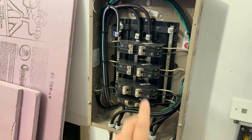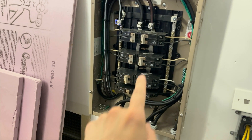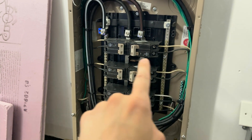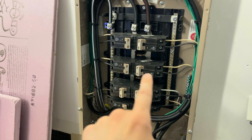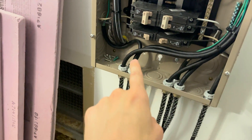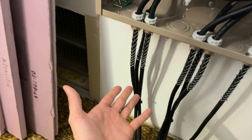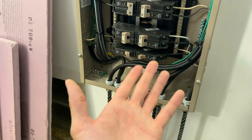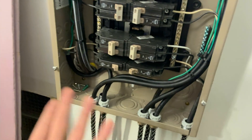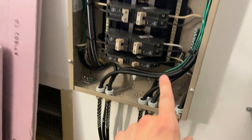So here's my sub panel. It's fed by a 100-amp breaker, number one aluminum wire, and I have 20-amp two-pole breakers here — that gives me 240 volts, 20 amps maximum circuit capacity. I'm using 12-gauge copper SJOOW wire, which is a pretty common heavy-duty appliance cord in North America. It's not commonly used in residential circuits, but it can be. And I have Kellems grip strain reliefs exiting the panel.